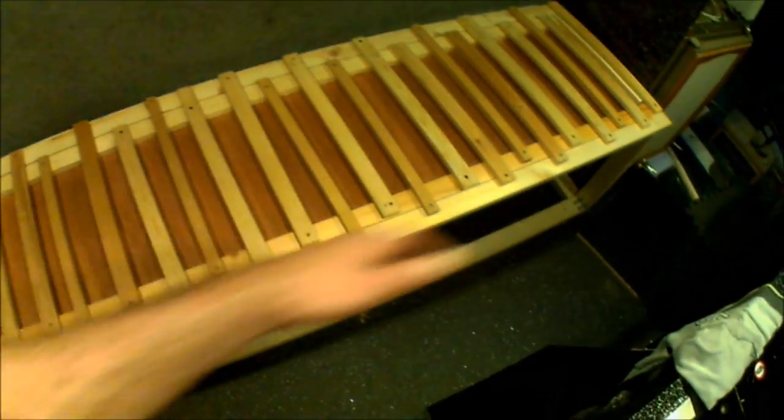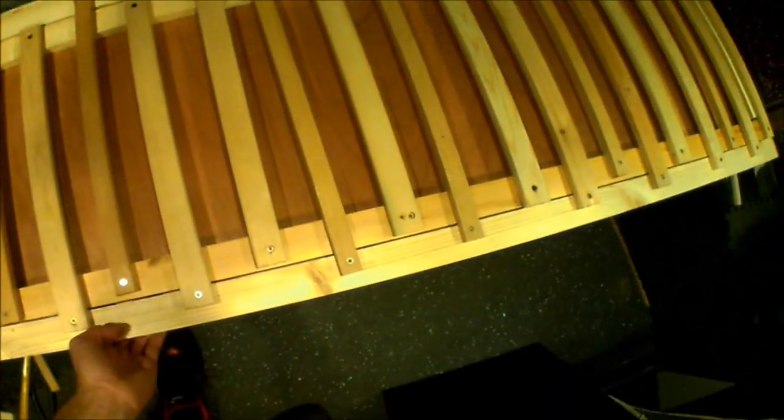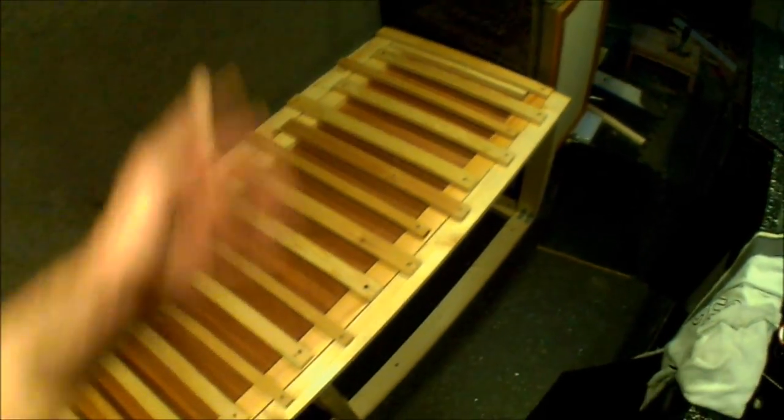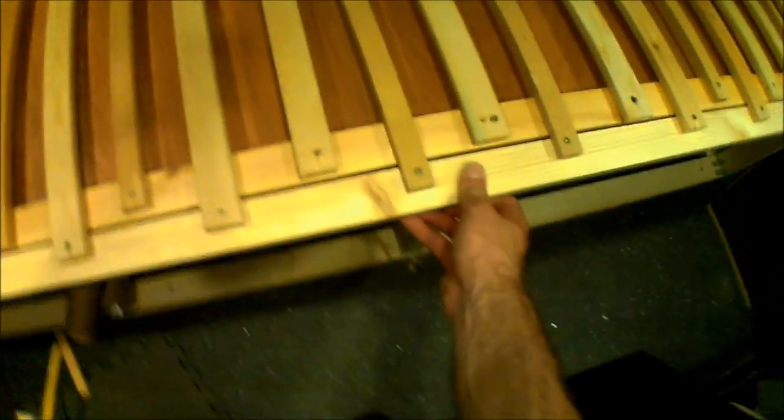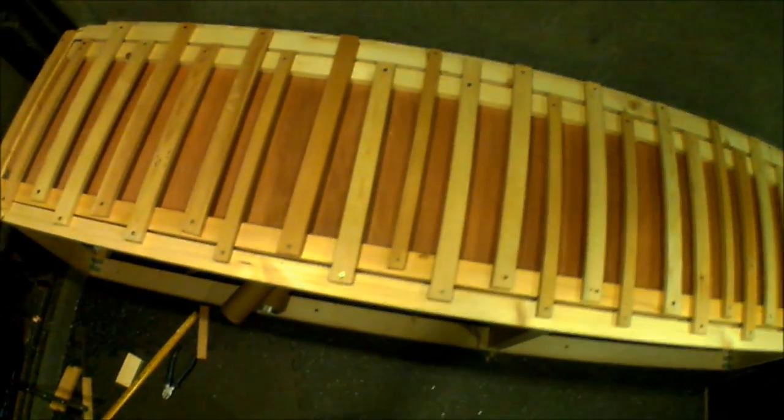Other than some legs and the front fascia, the bed is done. It's really easy to lift up and down with one finger — it's not heavy. I'll put a gas strut on the end anyway to support it when it's up. Motion-wise, it just slides straight out with no resistance. And because of that ply underneath, the bottom bar just can't fall through — unlike so many other beds I've seen online where they don't bother putting anything underneath and the bar just starts falling through, making it a real pain to pull in and out. With that little bit of ply, you just pull it backwards and forwards — straight in, straight out.